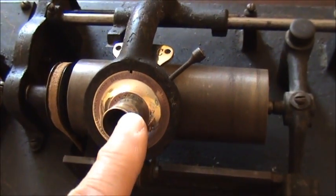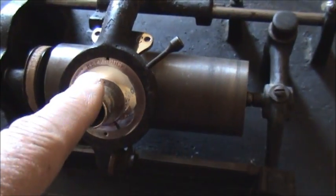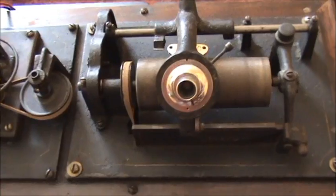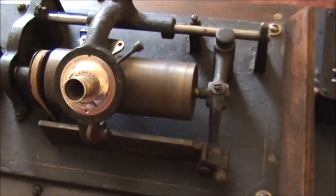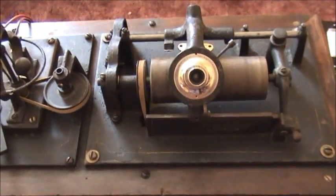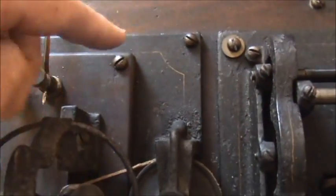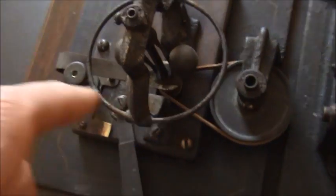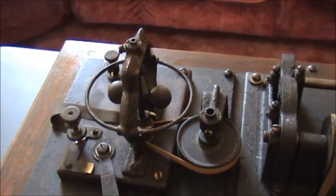These were all hand-forged by the person that built this. I put an Edison Model C reproducer in here from about 1902 or so — that's the only thing that I added to this. It originally came with an automatic reproducer from the late 1800s. There are a number of differences and interesting things about this. You can see that he added some hand scroll work here, which was interesting. This is the on-off switch. And it has a two-ball governor, vertical, as a Class M would be.